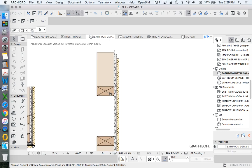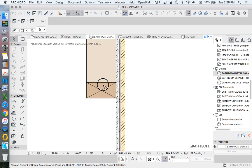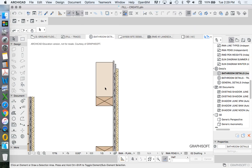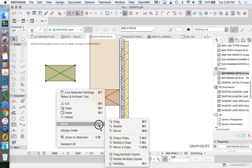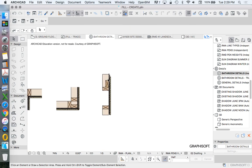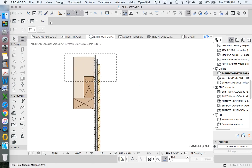So if this piece of timber isn't strong enough to support a very large span opening, we need to create this more like a lintel. We could have a plate here. Let's just leave the plate there. And then we'll create another piece of timber, and we're going to rotate this one and make it even bigger. So let's stretch this all again. Shape stretch. And we'll stretch that another 50 millimeters.